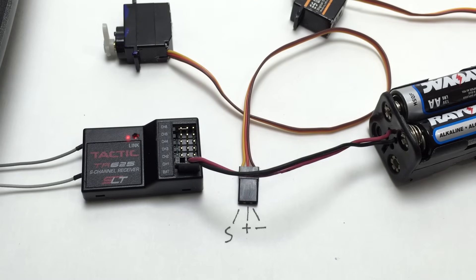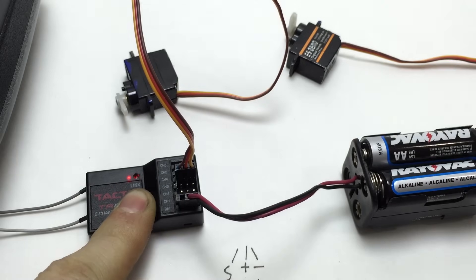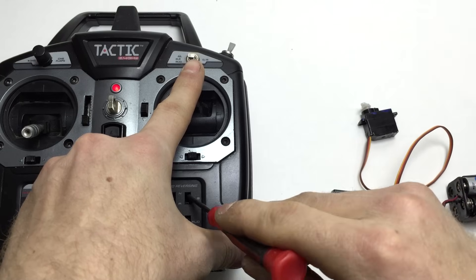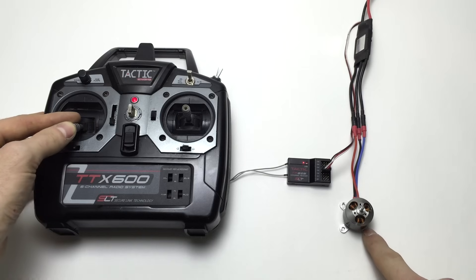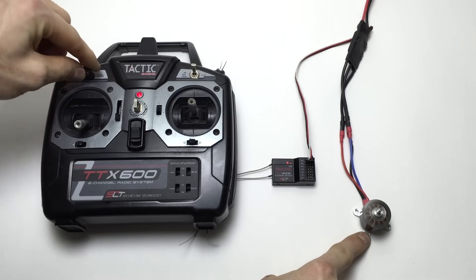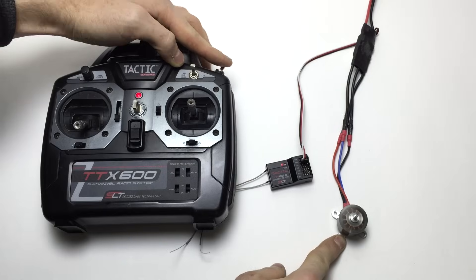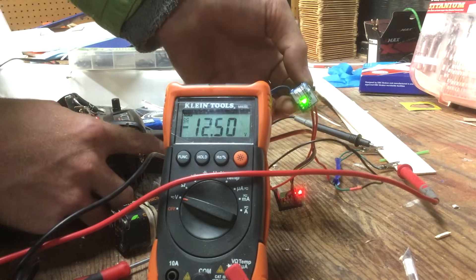They match up to the ground, power, and signal wires of a servo wire, which for whatever reason seems to come in two different color codes. If you plug something in the wrong way, it won't hurt anything — it just won't work. On most transmitters, each channel can be reversed, and the neutral point can be moved around with the trim buttons. While the speed controller is typically connected to the up and down channel on the left joystick, I could have any channel control it. You could use the extra channels to open a hatch or drop things, or even control different things like a relay switch.